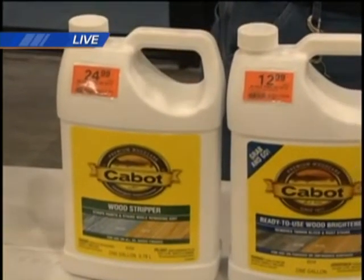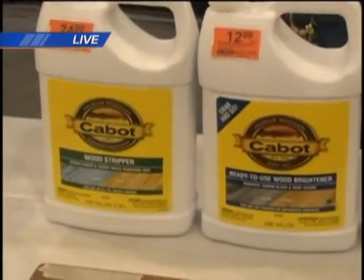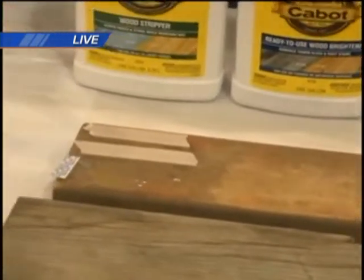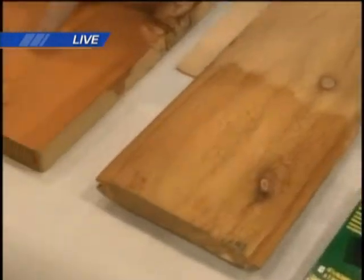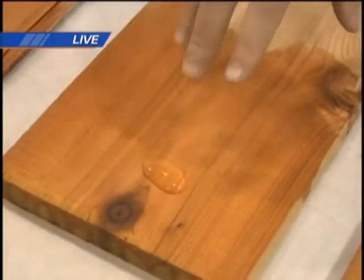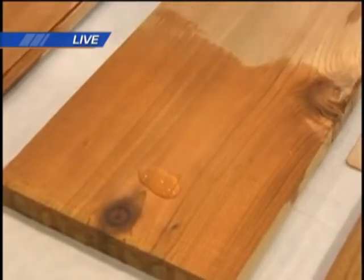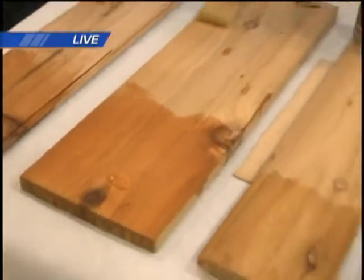After stripping, you may even want to sand it down to get it ready to apply your stain — and that goes whether it's a deck or a fence. First thing to make sure your deck is ready: do a water test. This water here you can see is soaking into the wood, so this one is ready to take stain. On the pre-stained sample, you can see how the water beads up. If the water beads up like that, you're not ready to stain — it's just going to waste the product and your time.